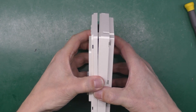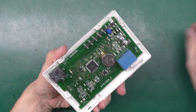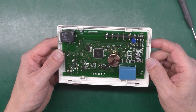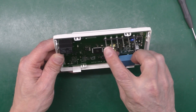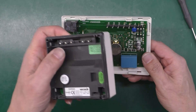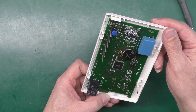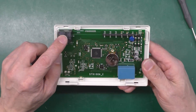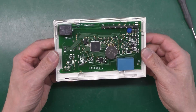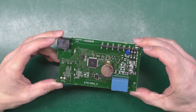Okay, that's most of the tabs out of the way, so it should just come apart. There we go — we've got a single PCB in the back. This is mains powered with a battery for backing up the configuration. This is the interface to the back plate on the wall, which is more or less compatible with the original back plate, so it was easy to switch out. You've got an ATmega MCU in the middle, the main single-channel relay with a changeover contact, and some power supply circuitry. I need to get the board out and expose the LCD.